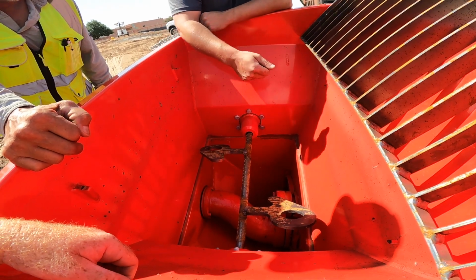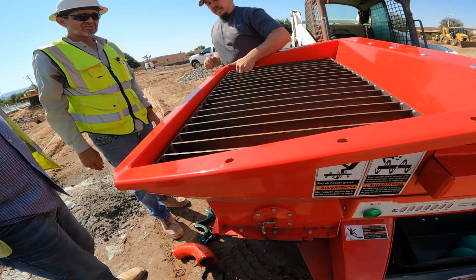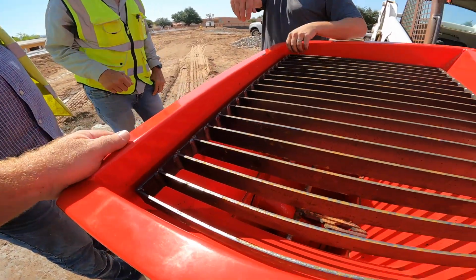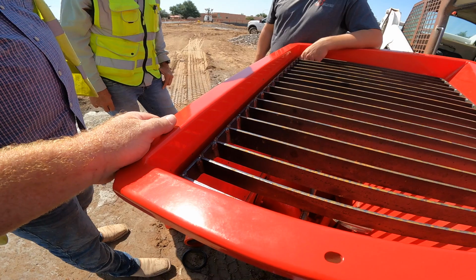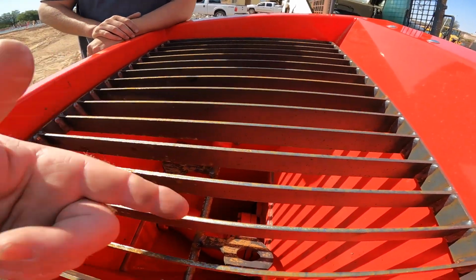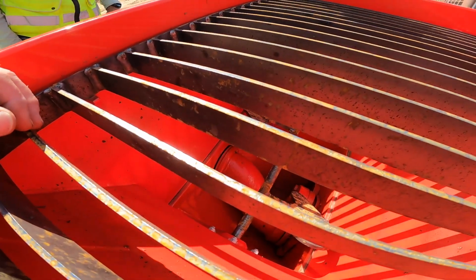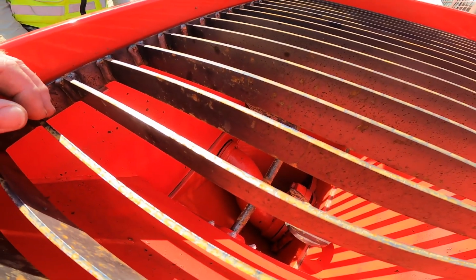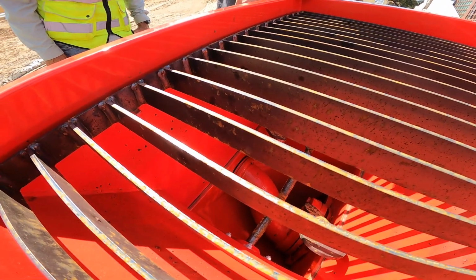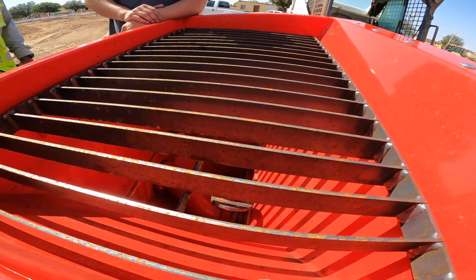You'll do the best you can on this side. You'll flip it back down, stroke that S tube to the other side, and then lift it back up and do the other side. But make sure you get on either side of that valve in those holes, because that's where you can really cause yourself some issues if you don't get that cleaned and re-greased. That grout just sits in there and that valve just works back and forth. It gets that grout and starts wearing on it.